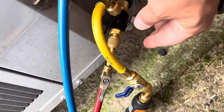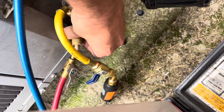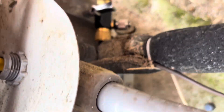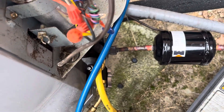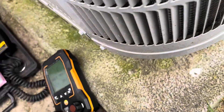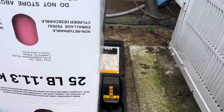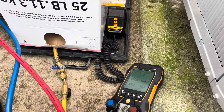Zero this off and we're going to bleed this until we have liquid — liquid refrigerant. Then we're going to start charging. Let's stop it right here — we've got five in it. Five point six. So we've got five pounds, six ounces in it right now. Let's cut her off.